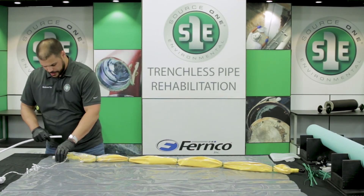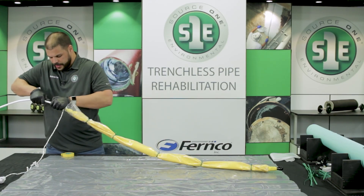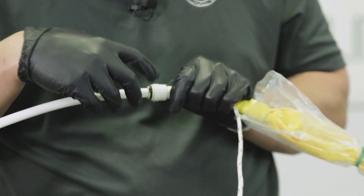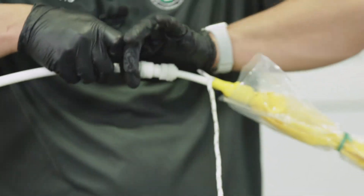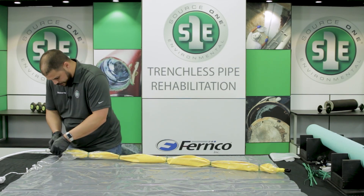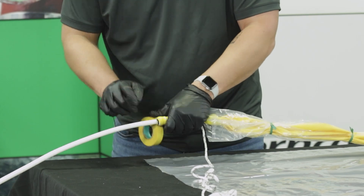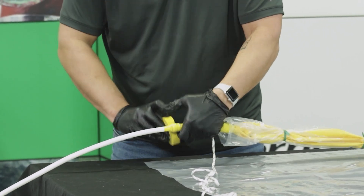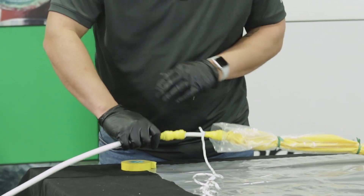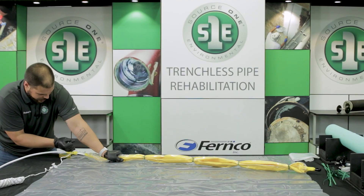Next, what we're going to want to do is make sure that we connect our push hose to our packer and also verify that there is a retention clip inside of this fitting. If the retention clip's not there, we have the opportunity of actually having this come out. Another thing we want to do is make sure that we tape the fitting just to cover that connection — reduces the likelihood of that coming apart. Make sure it's nice and snug, and also check our pull rope to make sure that's not going to move on us.